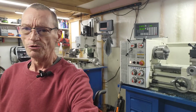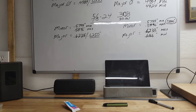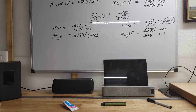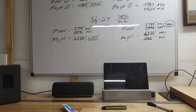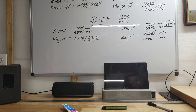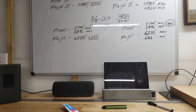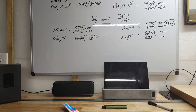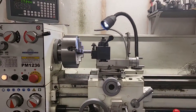I'm going to turn the camera around — it's on a tripod and gimbal so it should be smooth. There are the numbers on the board — I have specs up there for .308, 5.56mm, 9mm, and .223. That half-inch at the top right we're going to ignore; I already did a half-28 in the other muzzle thread video. Today we're doing a .308 in stainless steel with a 5/8-24 muzzle thread.